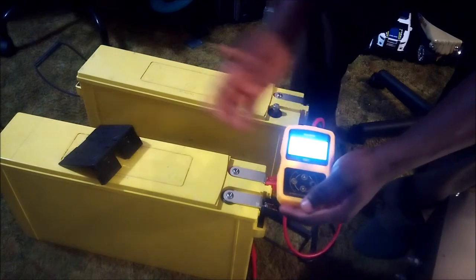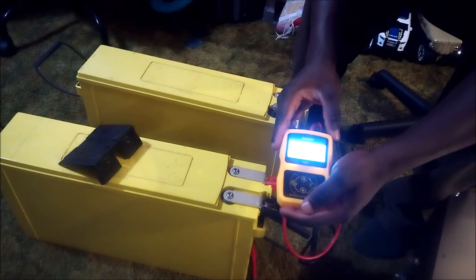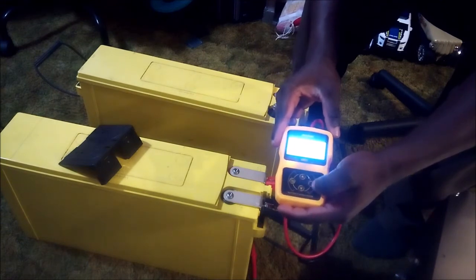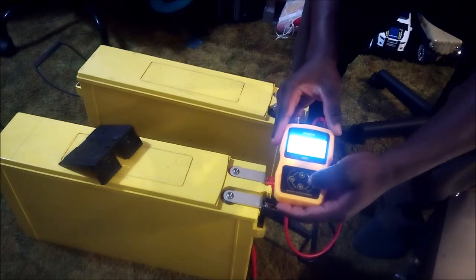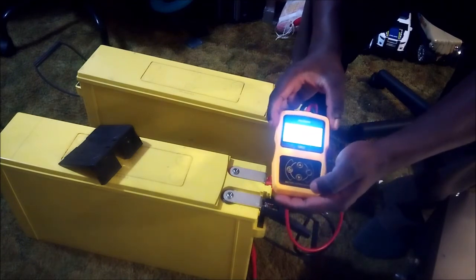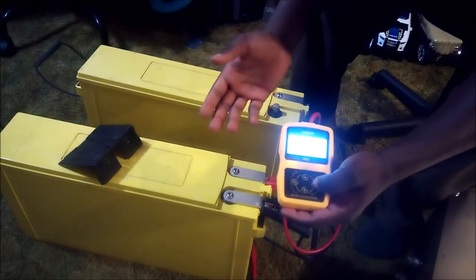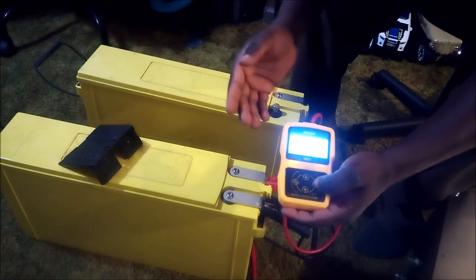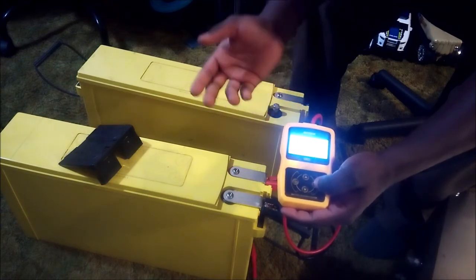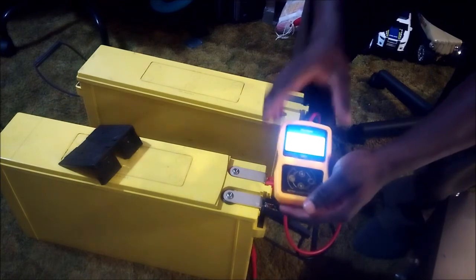So we are before charge. I would say after charge, because it's already reading 12.9. So I will say after charge and go for OK. And this is a regular flooded battery. And then for the CCA, I'll put 1200 for this, because for a used battery normally I'd be expecting around 1000 to 2000 cold cranking amps, but because it's already a used battery, I'm just going to leave it at this and put it up to test.